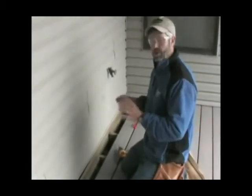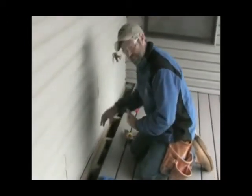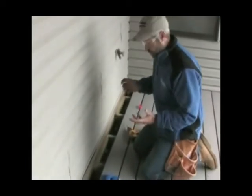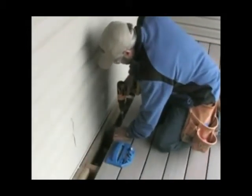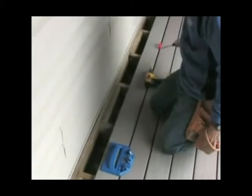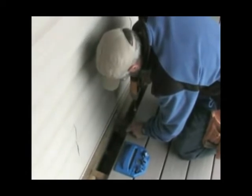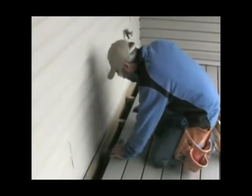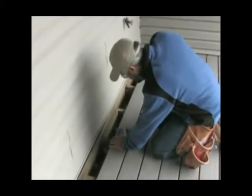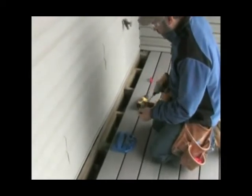When finishing up, you can't use the angle drill guide on the last board and a half because there's just not enough room. Instead, drill a starter hole using the bit and come down through the top. Run that screw to where it's just barely below the surface. For the edge of the board before the last, you can still do the standard drilling, but for the last board you'll have to drill both holes down through from the top.